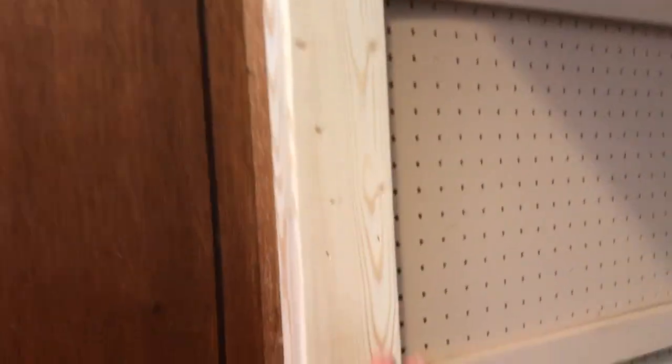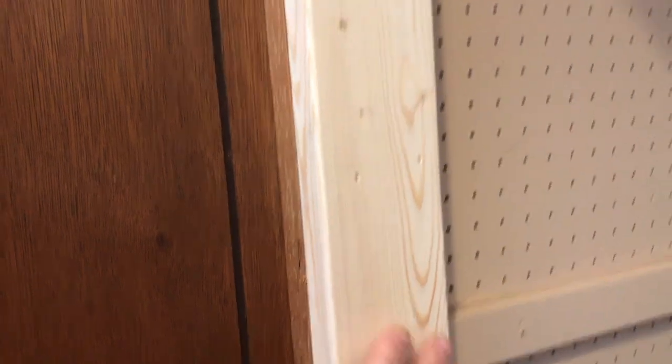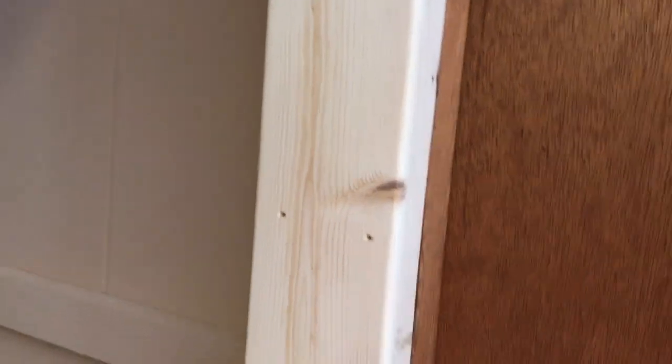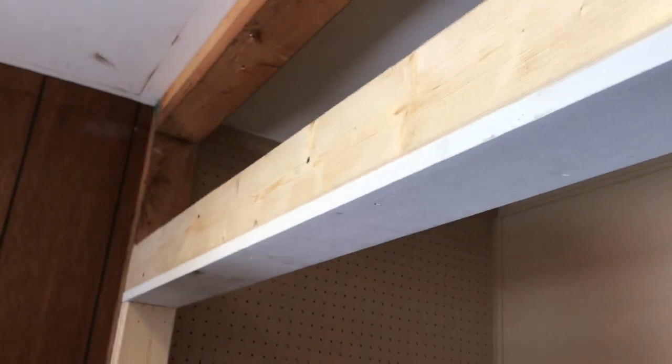You'll notice there's a piece of finishing board on the bottom here — the reason I used it is because I had it. I'm not going to put finishing boards down the sides. I actually sanded these two-by-fours for the jack posts and nailed them in with a finishing gun, because we're going to put a coat of dark brown paint on this opening — something very similar to this dark brown right here. There's no need to put a finishing board on there since we're in the basement anyway and it's going to look nice, but we're trying to cut a little bit of cost.